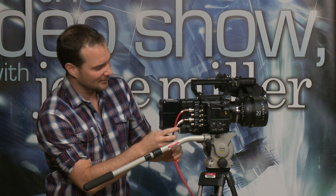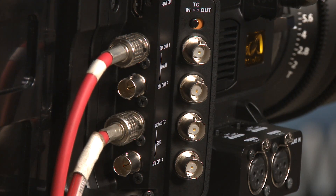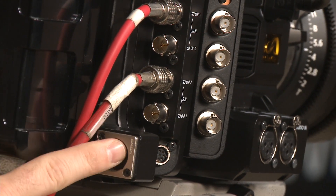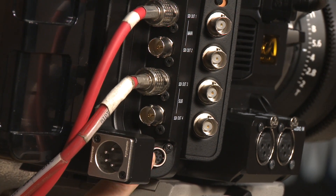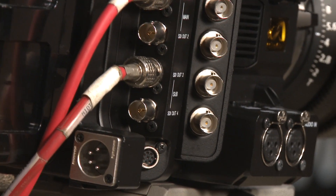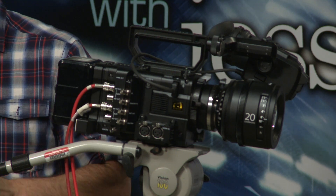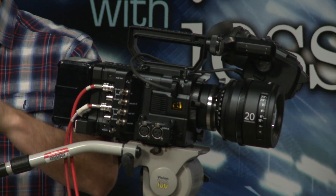Here's your 4-pin power jack. And finally, this little remote jack means you can plug in your RMB-750, your RMB-150, or whatever paint boxes you already had for your HDW-F900s, F3s, and 320s. All of your existing paint boxes will operate on the PMW-F5 and F55.